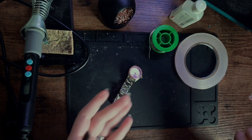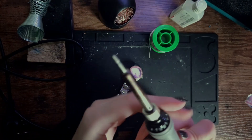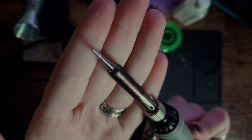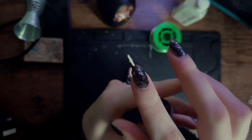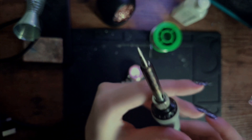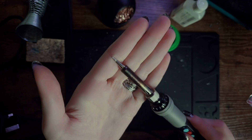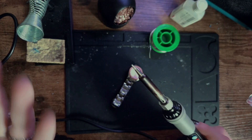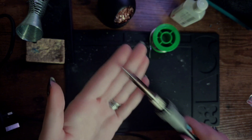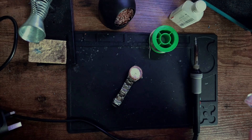Now when you buy a soldering iron you'll get a few different tips. Personally my favorite tip is this one here — it's not too thin, because if it's too thin you lose a lot of temperature, and it's not too thick, which means I can make these spikes easily. I did try all of them, so I think you should also try them all to see which one you prefer — maybe you'll find a thinner or thicker one easier. Also, I'll leave my first choice in the description.